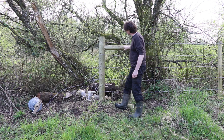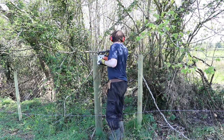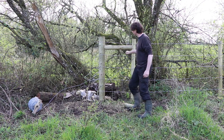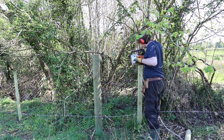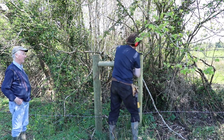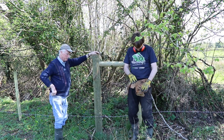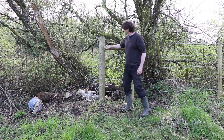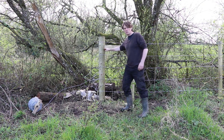What we do is make a simple mortise joint to hold the brace at both ends. I'd prefer to use a screw to hold the brace in position, because it generally doesn't split the wood and it's quite easy to drive. If you're hammering, it can be more difficult to keep it in position.